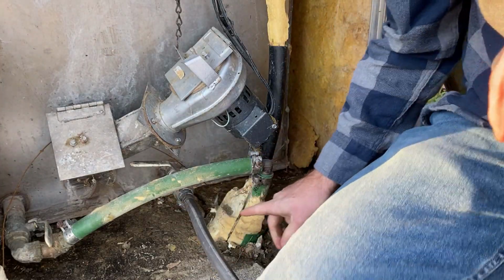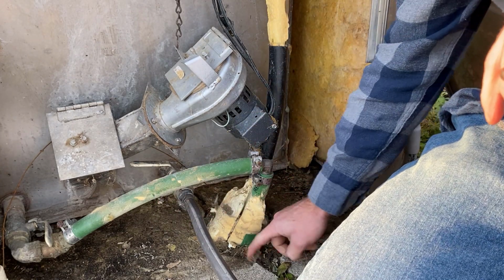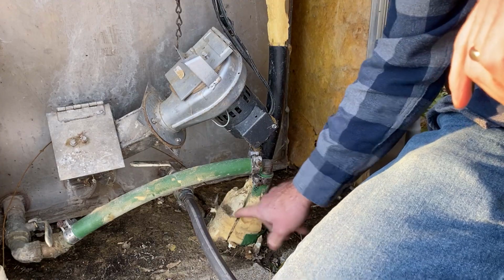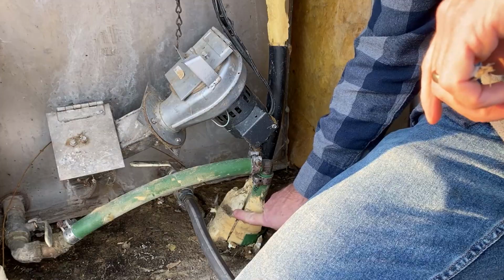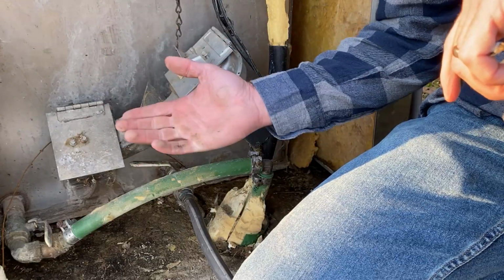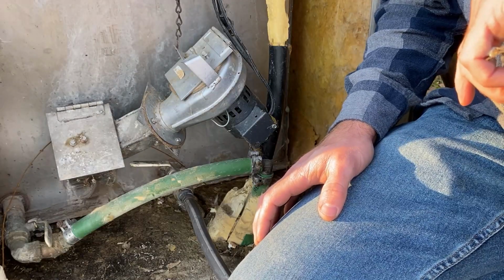And I mentioned to you earlier the boiler lines that were completely coated in foam. You can see this hard plastic here, hopefully, and then the whole system is completely coated in spray foam, which really does an amazing job at insulating these lines so that you don't have so much heat loss when it goes into the house. I don't want to be heating the ground out here and warming things up and melting snow. I want all the heat going through to that heat exchanger inside.